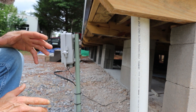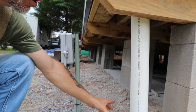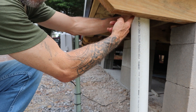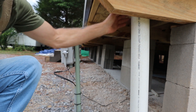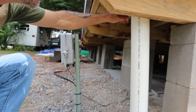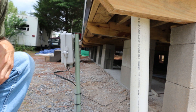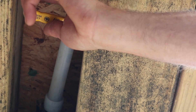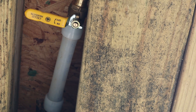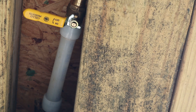Here at the front corner entrance of the cabin you'll see a piece of three-inch PVC pipe coming up out of the ground. Inside here I have that water main that is insulated — it comes up inside and below the surface so we can have it all protected when cold weather comes. This entire cabin is going to have skirting around it to keep it away from the cold air. My line is up through here, and I'll show you — I'm going to get down here and show you where I have a shutoff valve, which is the water main shutoff in case we have an emergency. The water line came up through the ground through the PVC pipe, and I put a shutoff valve here. This is where the start of our water system is going to be run from throughout the rest of the building.